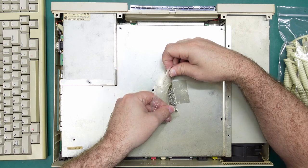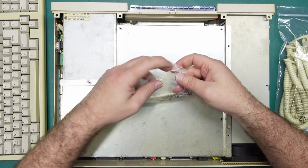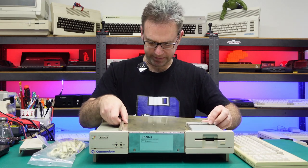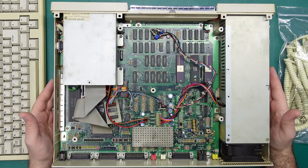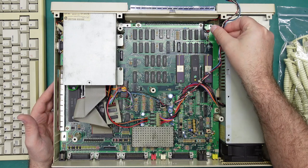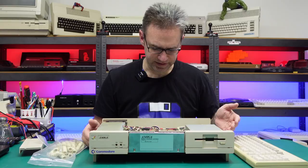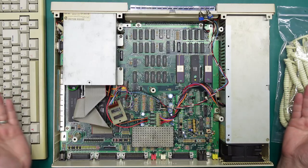Here are some screws - at least I know the screws are somewhere. So nice of whoever took the screws out to bag them all up, I guess. It would have been better if they put them all back in, but okay. This looks just like an RF shield. Inside we have a couple of switches - I assume these are what are supposed to go out the front. There is a random little board here with a couple of 74 logic chips on it, and there are some bodges. I don't know which bodges are factory, if any, or which aren't. I guess we'll figure that out as we go.